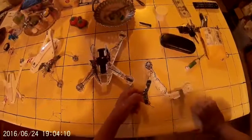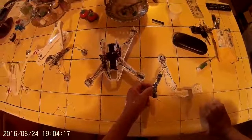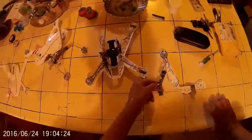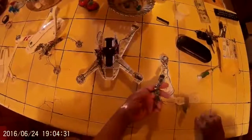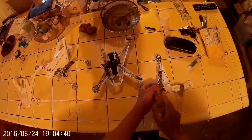This is the ESC that came off the Hornet. The Hornet does not have individual ESCs — it has a clockwise and counterclockwise ESC on one side and the same thing on the other side. So instead of four ESCs you have two, or instead of one like on the XK 251, you have two. They're fairly easy to work with, but I'm just a terrible solder guy. As far as I know this ESC might be good but it's just not making a connection and sending a signal to the motor.